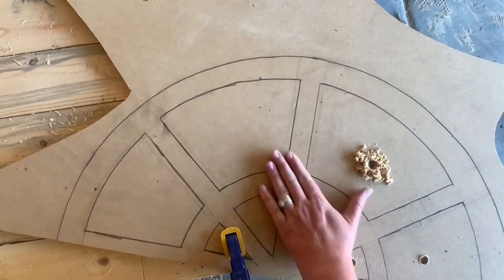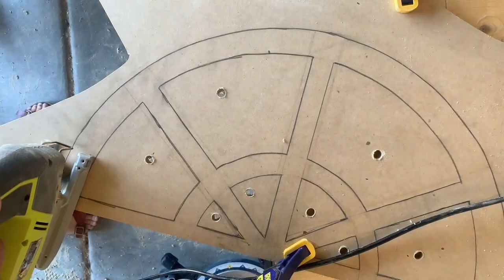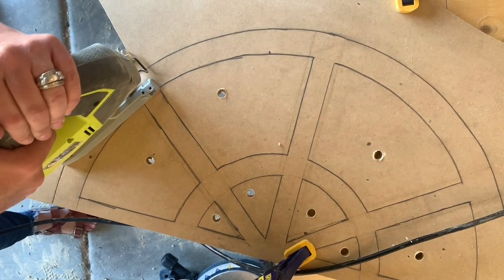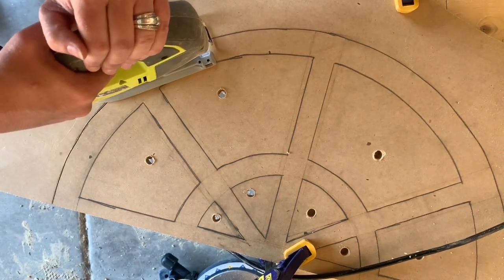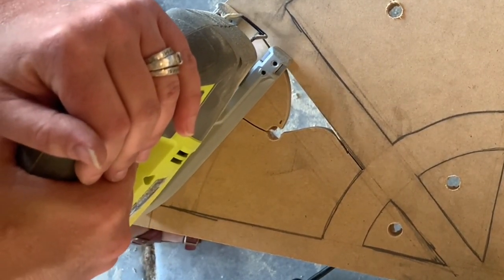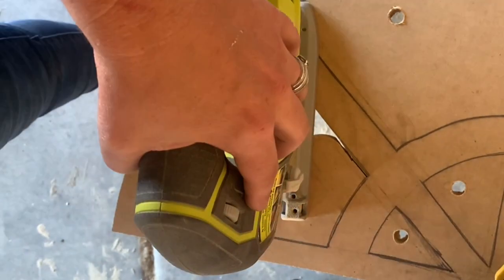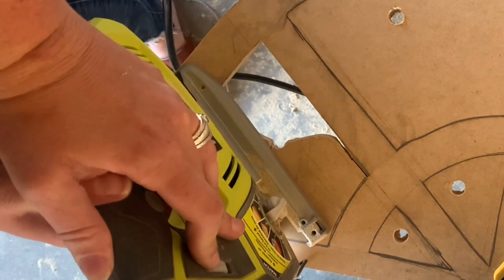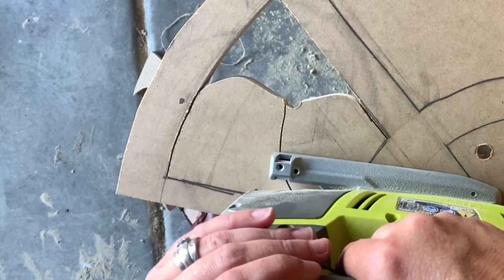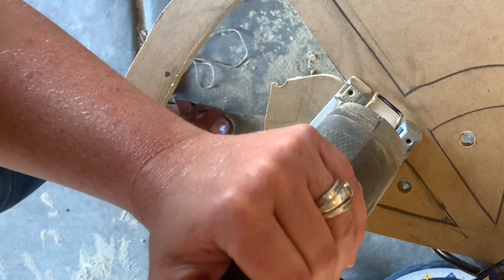Before you start cutting, you need to drill pilot holes in all the areas you're going to cut out with your jigsaw blade — make sure the drill bit is large enough for the jigsaw blade to fit through. Then you stick your blade down into the pilot hole and curve around. You can see how I put it through the pilot hole, curve around to get into the corner, then lift the blade out and switch directions to get the corner space. Do this with each corner or point in every space.